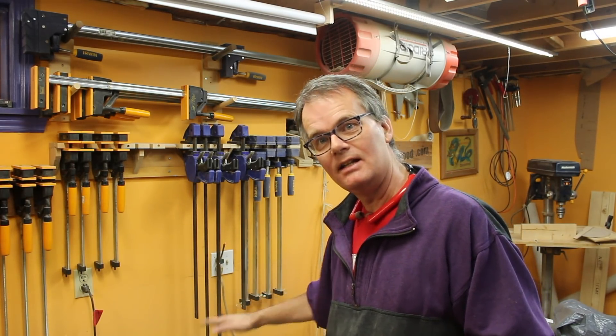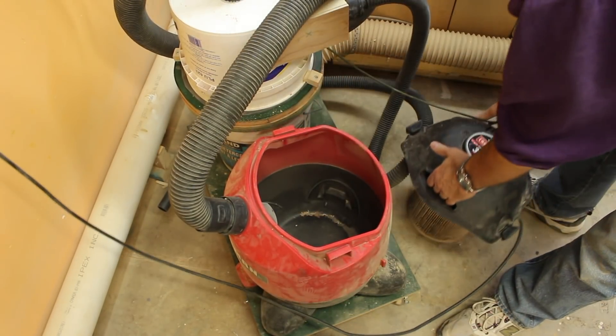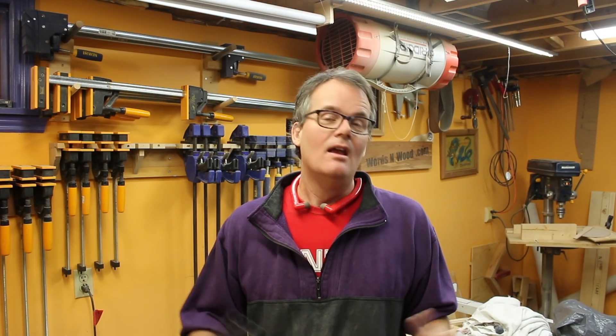I realized this isn't a very satisfactory way to end the video because it feels like there's a lot more suction now with the improvements. I can see the lid of the upper bucket actually sucking down when I close it, and it sucked up the dust on the floor really quickly. I don't have any numbers though — sorry, you get what you paid for. I paid like $25 the first time for a new hose set, and this time I spent like $5 on weatherstripping and I think I have a very much improved shop vac. There's basically nothing inside the bucket — it's all getting caught by the baffle cyclone. So I'm happy — great little shop improvement.